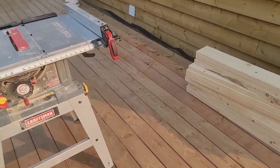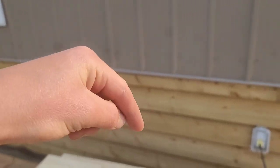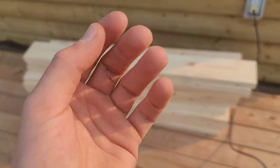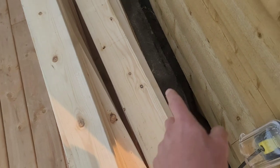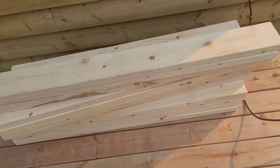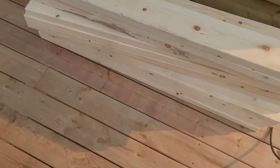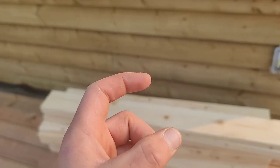Tonight's adventure: we are making the 2x4s that are going to go on the bottom and top of our railing, then we have to drill all the holes for the wooden dowels to sit in. Because it's so hard to find good lumber and good 2x4s, we decided to use up a bunch of our leftover 2x6 and a couple pieces of 2x8. I've got to go through all these, rip off whatever side I don't want first, making sure I leave my 3.5-inch side. Actually, we're going to go 3-inch instead - that way we can get more of the garbage cut off and it'll give a nice little reveal between the 3.5-inch wide posts. Got all our 1.5-by-3-inch pieces - there are 22 of them, 11 openings, one top and one bottom each, both on the flat.